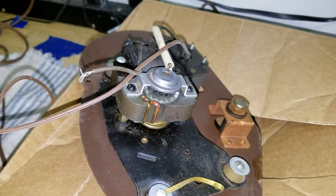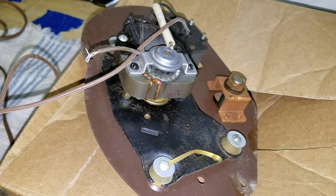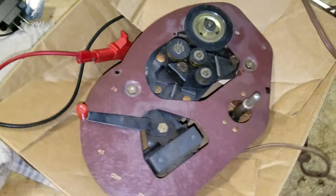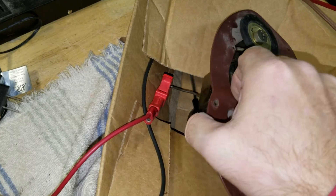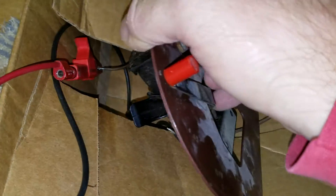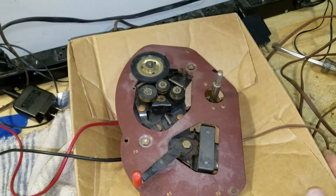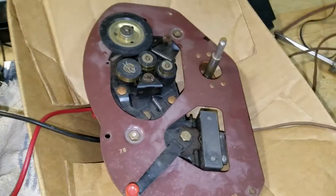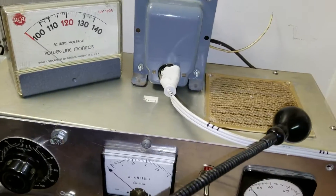I haven't tested the motor yet. The owner believes the motor works, so I'm going to give it a try. I'll hook it all up and test it out. I've got it all connected. The switch is dead on this, so I'm working without the switch — just line voltage leads going to the motor leads, disconnected from the switch. I like to do this on a box so I can pack all the scary stuff down away from me. I've got it plugged into my Variac, which is plugged into my isolation transformer.